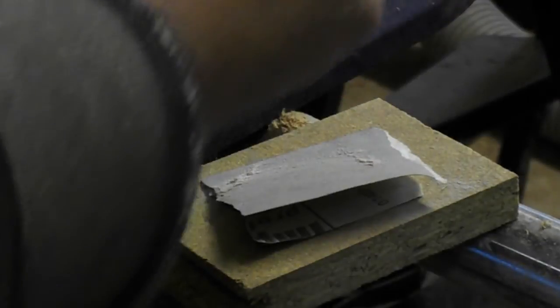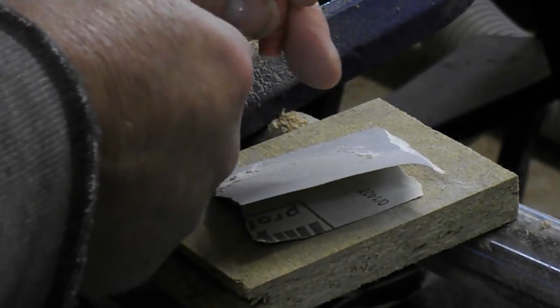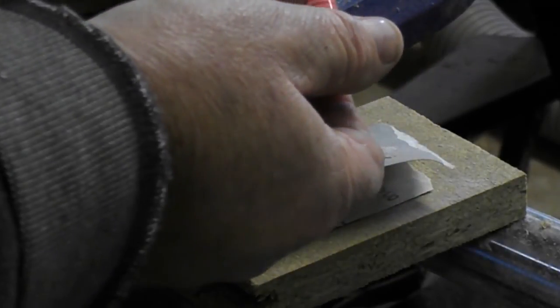At the end of the blank. But when you got four coats of glue on this, remember, the glue itself is probably almost a millimetre thick. So that one's all sanded down to the brass now. Other end, about a millimetre again. Getting pretty good at guessing where the end of the bushes are now.